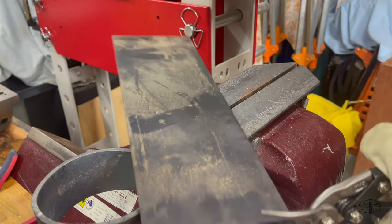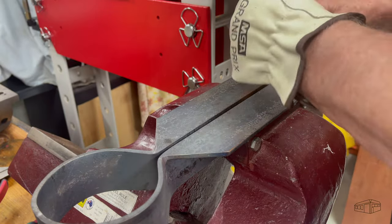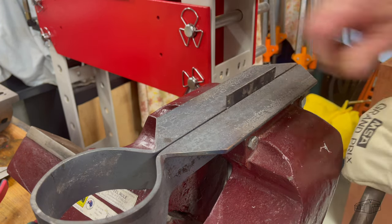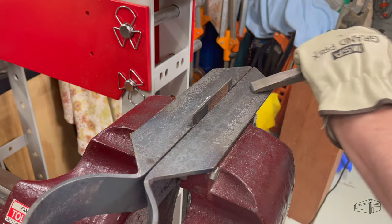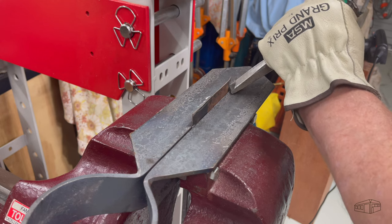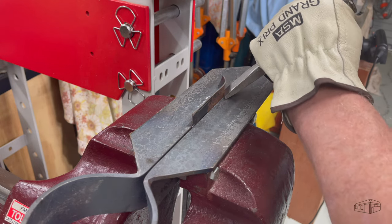This tool is not just for bending steel — it can be used as a shear as well. I'll use some aviation shears to make cuts on both sides of this two millimetre offcut on the line I want to cut. This will deform the edge so that it will seat on the face of the tool leaf. Then using a cold chisel and hammer, I can shear off the waste piece. The bench is moving around a little as it's mounted on wheels and not bolted to the floor.